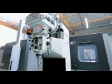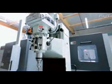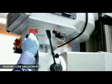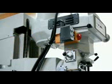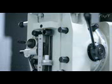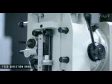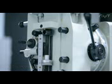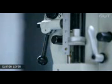Another feature found on many conventional machines is the power quill feed. With the power off, the power down feed transmission can be engaged. The speed selector gives you a choice of 3 different feed rates. The power can then be turned on, and the feed direction knob can be pushed forward for downwards feeding. Finally, the clutch lever is pulled to the left for quill engagement.